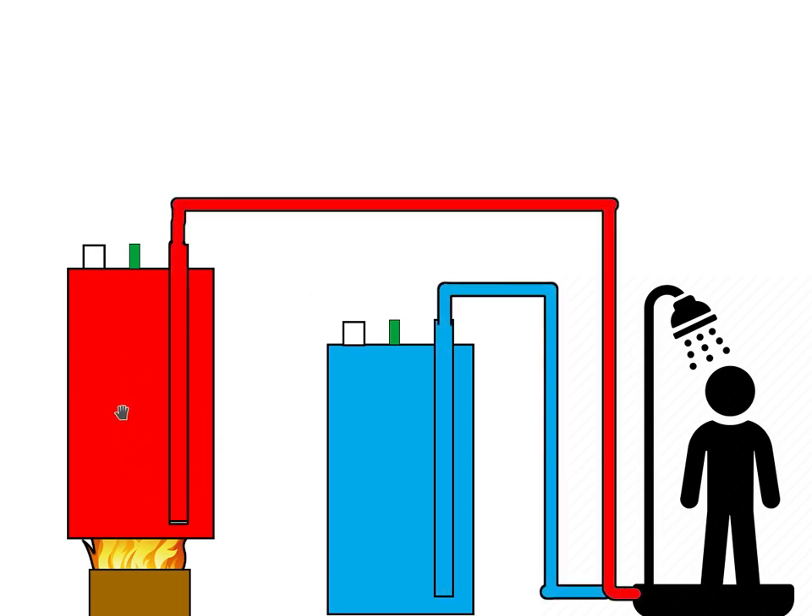You would add an extension with an on/off valve so you can close it when it's in operation and open it when you need to refill, since there's no regular inflow water. Having that valve where you can close it, build pressure in here, then open it to refill — that's a good thing. Water comes in, the hot water boils and pushes the hot water up the pipe and out. As for how the cold side is pressurized — you create a cross-link so that as the water heats up and boils, it builds steam and that pressure comes up and pushes on the cold side.